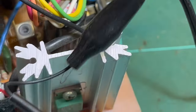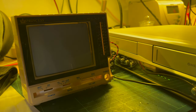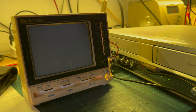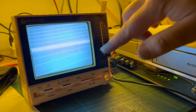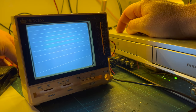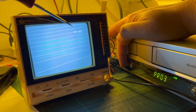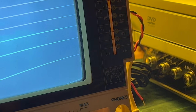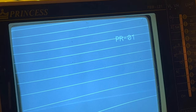I've hooked up an RCA cable with the signal wire and ground hanging off there, and I'm trying to find something that outputs AV — I've just got a DVD/VCR player. Power on the TV, power on the VCR — saw something! Changing the program: AV1, AV2. So apart from the horrible horizontal retrace, it's working. Too easy!